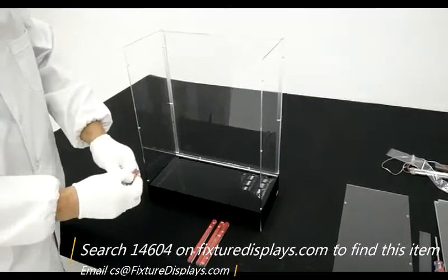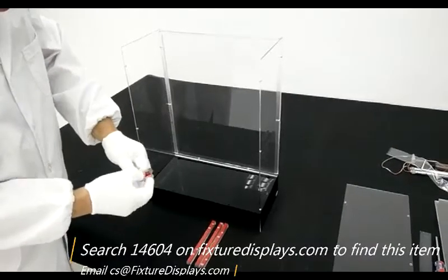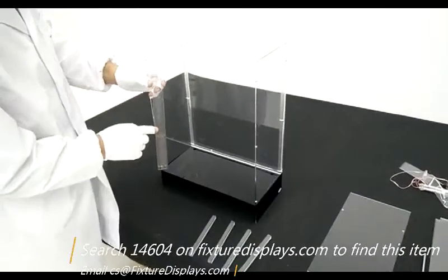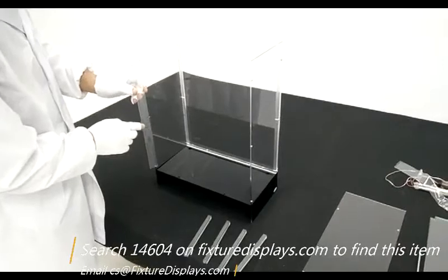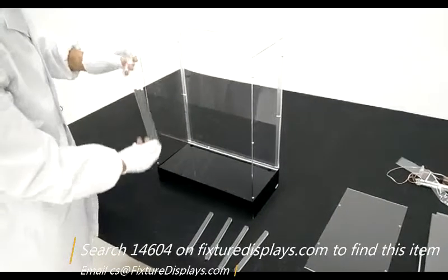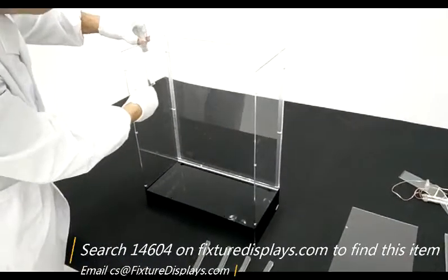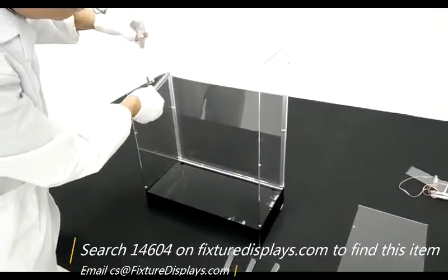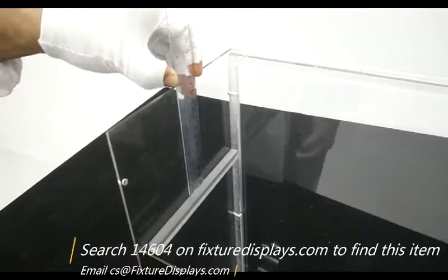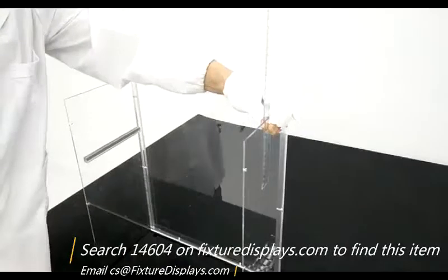This is the time to put the glue strips on. You can certainly also do so before you assemble the side panel altogether. Measure your products and make sure you have your dimensions correctly calculated — measure twice and glue once. In this particular case, we're randomly selecting a 5-inch distance to position the left-hand side glue strip. Make sure you do this carefully and slowly so that they are even.